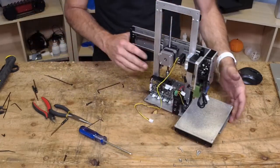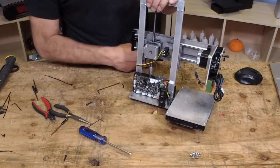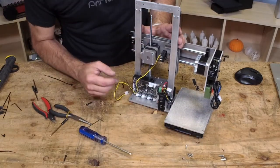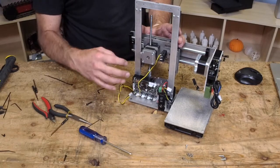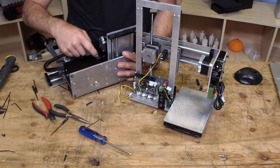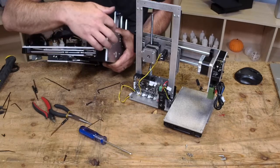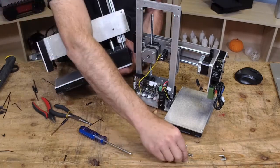So just let me give you a couple of, let's see, what's the best place for this? All right, so there are some printed parts that aren't here. Like I mentioned, the handle, 2 screws for the handle. Here, 2 screws for the filament spool holder. Down here, there's 2 screws here and the one that you used here, so that's 3 to hold the printed case. So the printed case is 1, 2, 3 holes, and you switch out your switch to go into there. And then on the back, there's 1, 2 little plastites, and the barrel connector goes there. So you'll need 1, 2, 3, 4, 5 plastites for that one. And over here, it's this printed plate, 2 small button head screws that are included there as well.